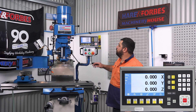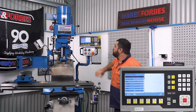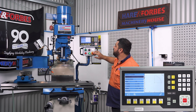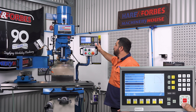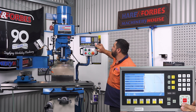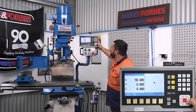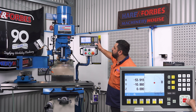The next function is the two radius cutting functions. We have the simple radius function, which will cut a 90-degree radius, and then the smooth radius function, which allows you to adjust the angle of the radius to whatever the job requires. To set these up, select simple or smooth depending on what you're doing, the plane, the X and Y centre position, the diameter of the radius, the quadrant you require, the inside or outside cutting edge, the direction of travel, your max cutting size, and the diameter of your cutter. Once you input all those parameters, hit enter — it'll show you all the machining points. The red dot is where you are and the little circles are where you need to be, and you cycle through and machine each and every one of those points.